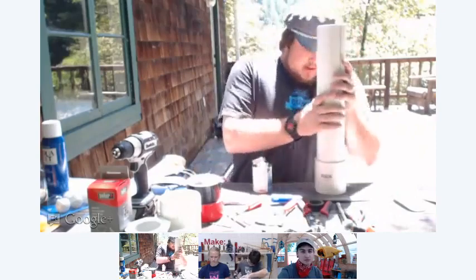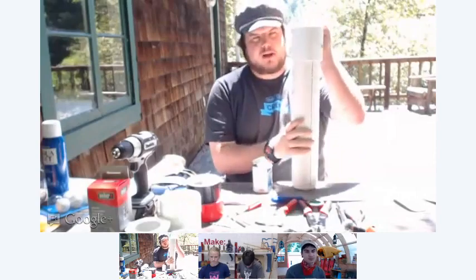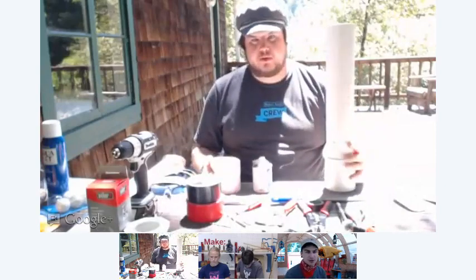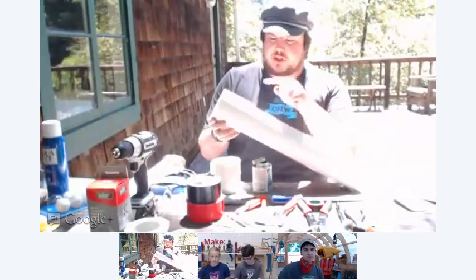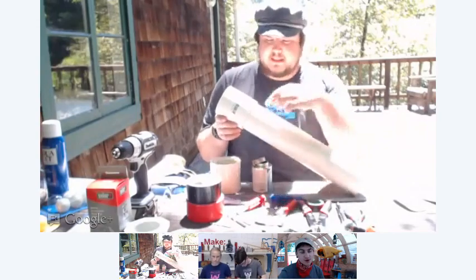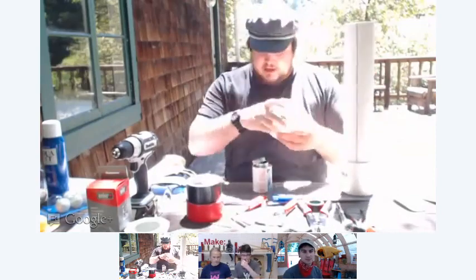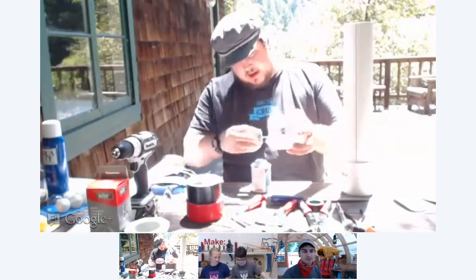Okay. Right? And when you push down your part, you want to rotate it a little bit and then push down all the way so that makes sure that there's no gaps or leaks or anything like that. All right? Because this has to be airtight, really, right? Right. Yeah. And one important thing, make sure your slip coupling is near where your electrodes are. Right? Okay. This is going to become the front of your cannon, and this is going to become the back of your cannon. All right, so here's the female threaded adapter. Take some more glue. Just do it on the inside.